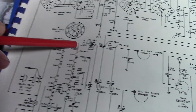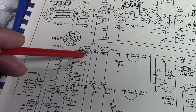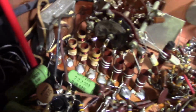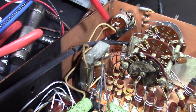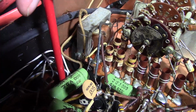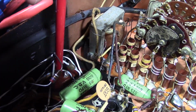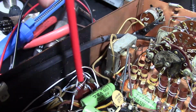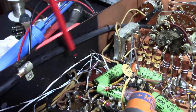So the AC line goes through a small resistor inside the ballast to provide a little surge protection for this cap, and then the junction of two diodes. Well, the negative does appear to be going to one side of the AC line directly, not through the ballast resistor. And then the positive, well, here's a junction of those two diodes, and that is not going to the positive like it used to. Instead, one of the diodes goes there. The junction's going through this very small resistor, and it's 2.7 ohms, off to something I haven't traced out yet.